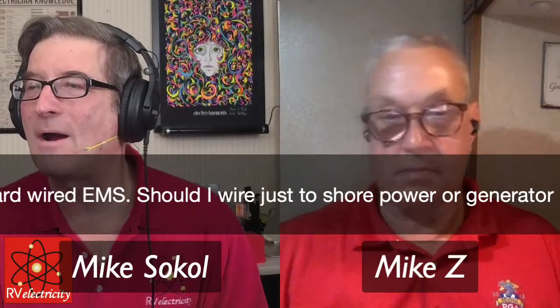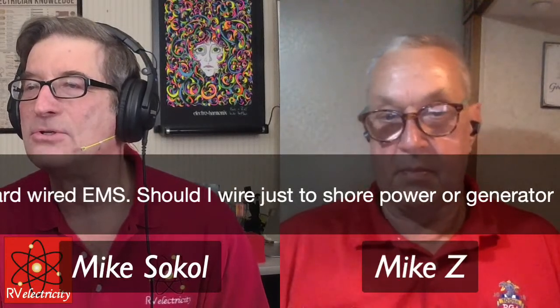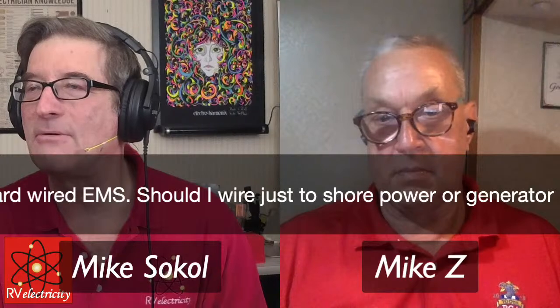Finally bought a hardwired EMS. Should I wire just to shore power or generator also? Okay, so this is a question that comes up all the time. In EMS, we could do a whole class, just on EMS units. So basically, you can in fact set it up so that it's where it comes into the RV from the outside world, or after the transfer switch, so it has the possibility of shutting you down if the generator goes over voltage.